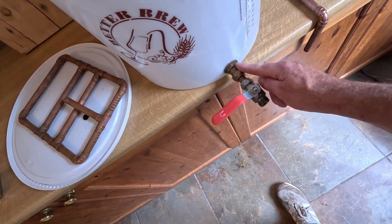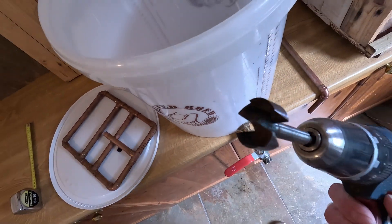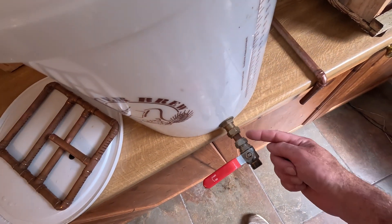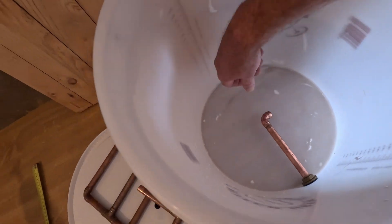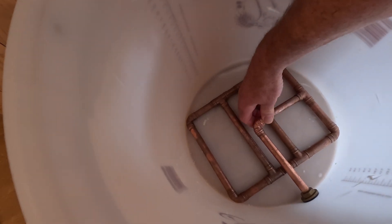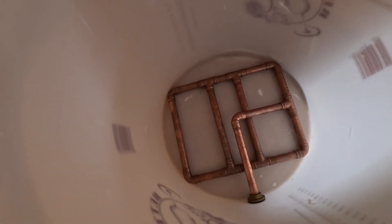You need to drill a hole for the tank adapter. This has a nut here that screws onto that, and this obviously requires a hole. Take a measurement of that — job done. This fits in, tightens up. You then put a piece of pipe through the adapter, and then your ball valve screws onto the end of it. So I've got my pipe in here, and this just slides under and fiddles on like that. It takes a little tinkering — getting the pipe just the right length — but got it sorted.